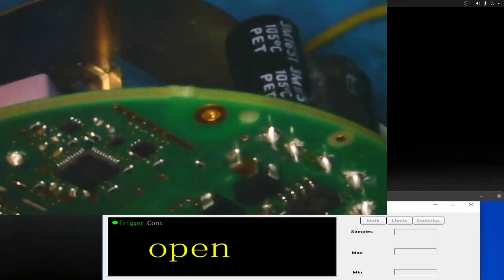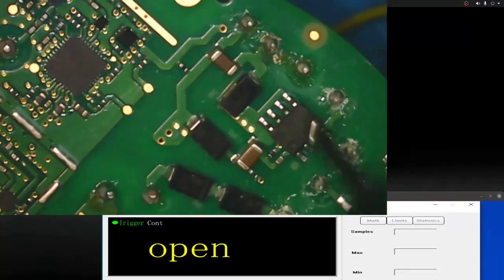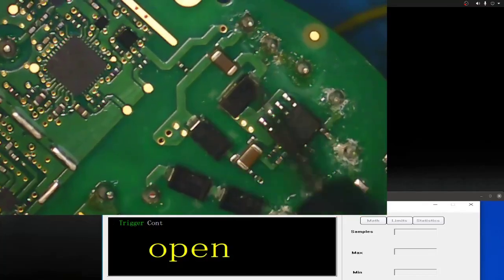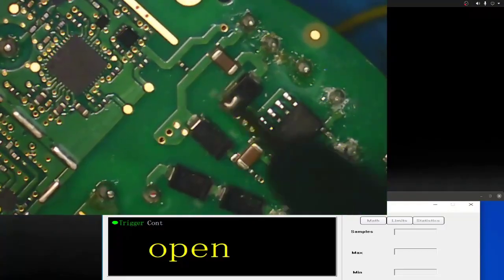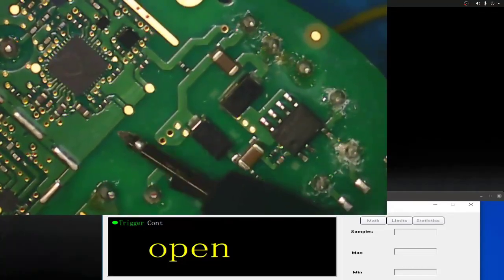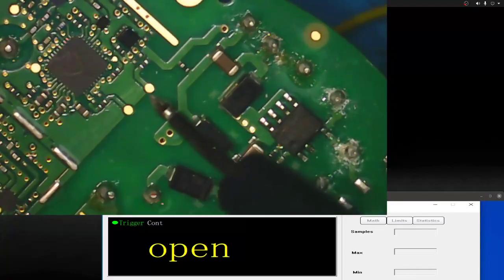It is physically impossible that through this switching power, basically it's with the caps on the other side, and this, it makes up a switching power supply. We've got the bridge rectifier, we've got the switching MOSFETs, underneath we've got our smoothing capacitors to smooth the electrical charge out, and this is just basically taking all that power and then it goes to a rail for our MCUs, our positive rail. We're not tied in at all on our low voltage side, and all the components on this low voltage side are rated for 3.3 volts. So just here, for instance, we would expect to see a voltage regulator, but we're not.